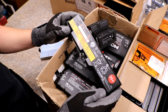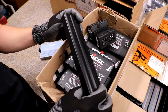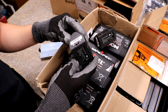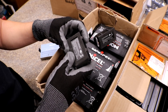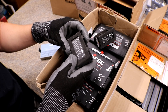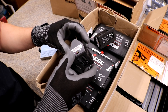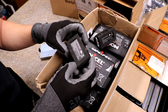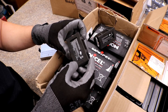There was also another laptop battery pack — a Lenovo, marked bad. I'm guessing there are three cells in there. They say 10.8 volts, 2,200 milliamp hours, and 23.76 watt hours. I've opened something similar in the past and it had Samsung pink cells that turned out to be at least 2,200 milliamps, so I'm really hoping these are in good shape.